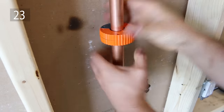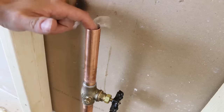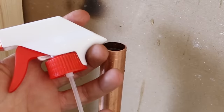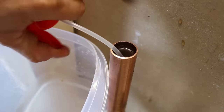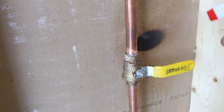Number 23 is one of my personal favorites. Let's say you cut a vertical pipe and there's a bit of water left inside. You want to remove it without taking the chance of dropping anything inside the pipe. So what I do is grab a spray bottle head and use it to pump out most of the water. What's nice about this trick is that you could also use the spray bottle as an extinguisher.